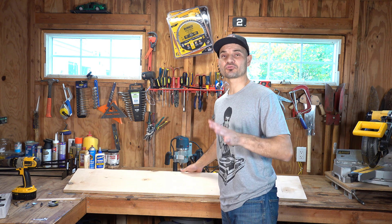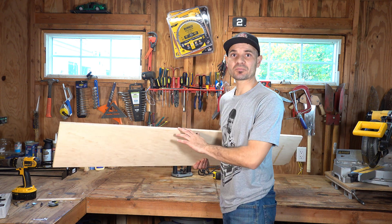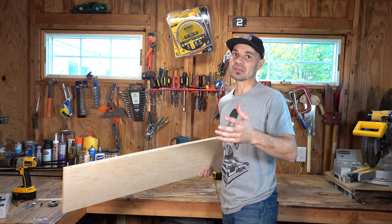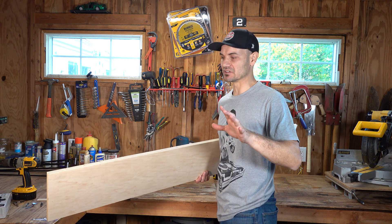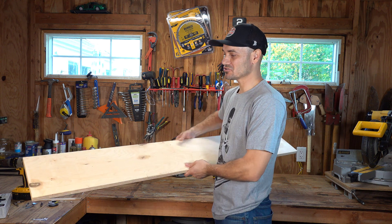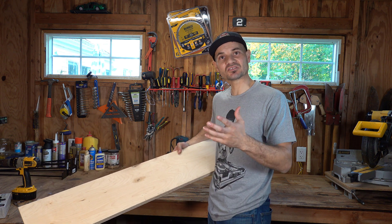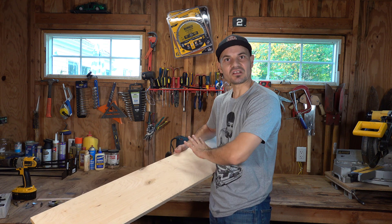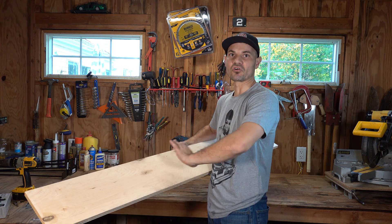The first thing you're going to need is a three-quarter inch board. I definitely recommend three-quarter inch because it's not going to give you any kind of flex or bow like a half inch or quarter inch will. Stick with three-quarter, and plywood has been very expensive lately, but if you can get a nice finished top it's just going to allow for nice smooth back and forth with your router.